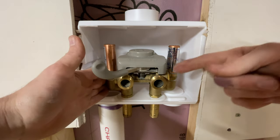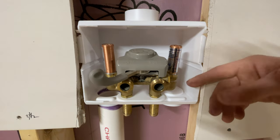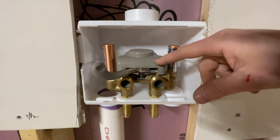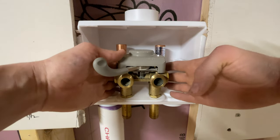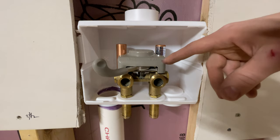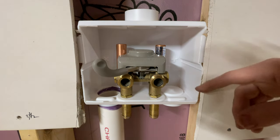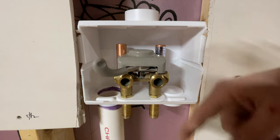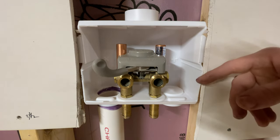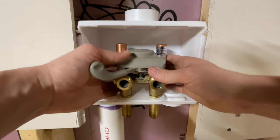The hoses going to your washing machine typically always have pressure on them, unless you have valves that you can close or something like this. Sometimes those hoses break, and that's the reason why some people get water in their house. Those hoses break, and then you have city water pressure flooding your house. What's nice about this is if those hoses ever break, well, it'll only run for a maximum of 2.5 hours. So it's a safety device. That way you don't flood your house.